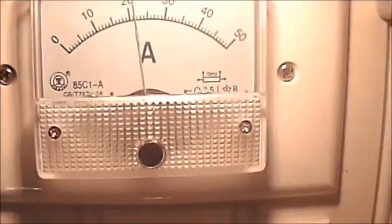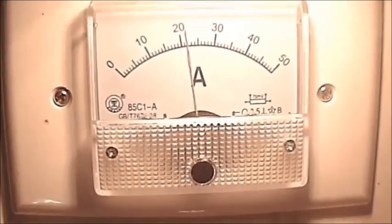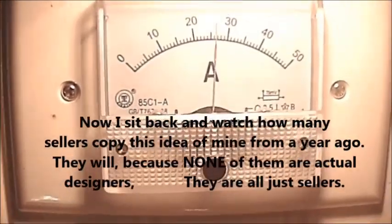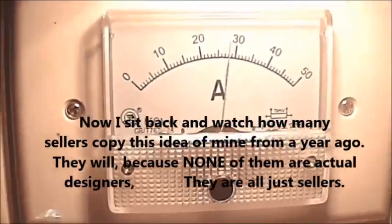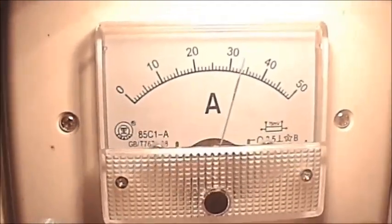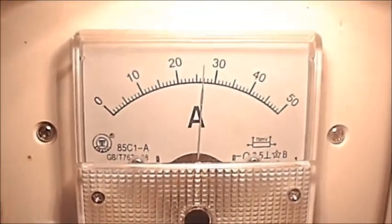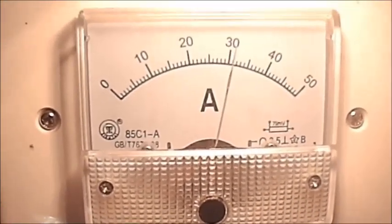I've got a fan on right now trying to drain some of it down. We also have an 800-watt heater unit that's burning right now, just trying to keep the voltage from shutting down all the inverters. This thing here is a Thermodyne PMA. I did shift the core back a little bit so that it's not stuck in the iron field — it gives a little higher frequency so its output is better. It increases voltage by about 5% but increases frequency by about 15%, which really made the difference.